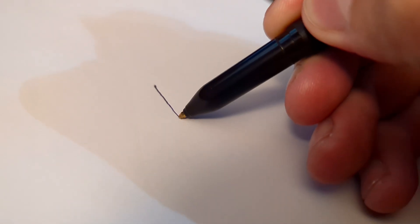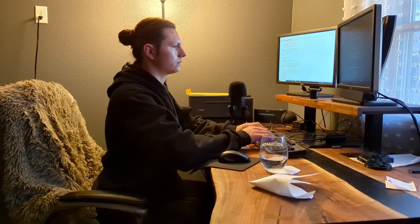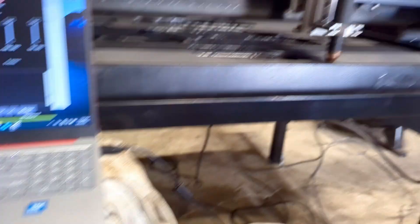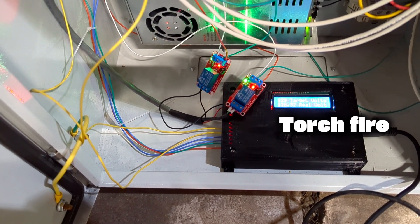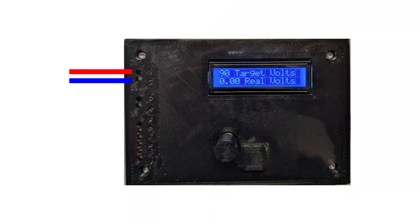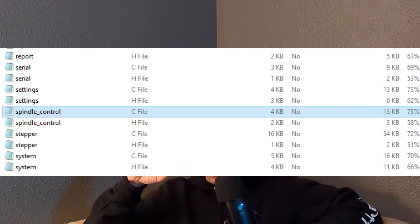I started drawing parallels between the laser mode function and what I needed the plasma cutter to do, but I didn't want to make an anti-dive circuit. After thinking about it for a while, with the help of the DIY CNC plasma cutter god and ChatGPT, I decided to modify the GRBL firmware to fire the torch like normal and turn a relay on and off based on the acceleration and deceleration of the current program. When those two wires are off, the THC loses control — ding ding ding, we might have a winner. Spoiler alert: it's a winner.